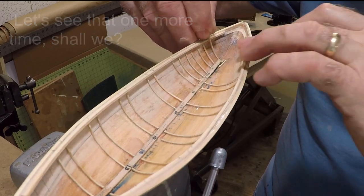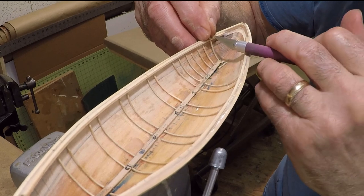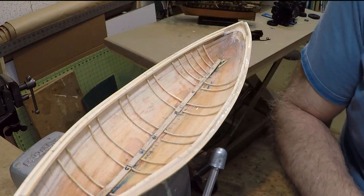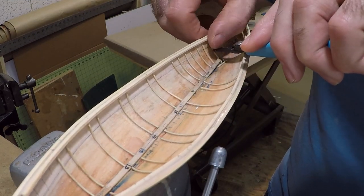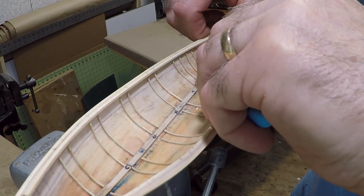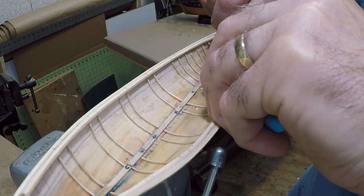So here, as you might have guessed, I'm using the frames inverted. I only need a small amount of curve for the bottom, so all the excess was cut away from what used to be the top. Then you'll see me measure, scallop, and fit the frame in place. And that's it for framing. It's really no more complicated than that. Cut, fit, glue, repeat. Done.